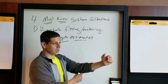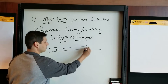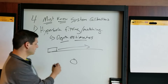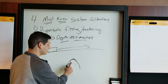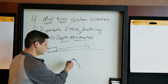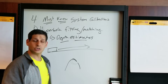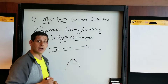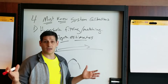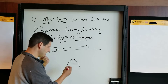How does hyperbola fitting or hyperbola matching work? You're in the field pushing your GPR across the ground surface. There's a target below the surface, and as you push it the response is going to look like a hyperbola — that's your actual recorded response. The pipe or target is what's below; your response is a hyperbola. Your system knows how fast the GPR wave has to move to create a hyperbola with that specific geometry, and it allows you to create a fake hyperbola and match its shape onto your recorded hyperbola.